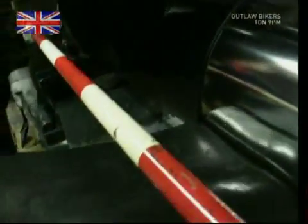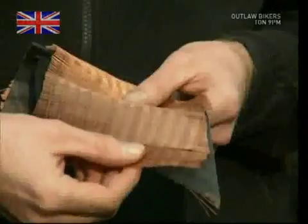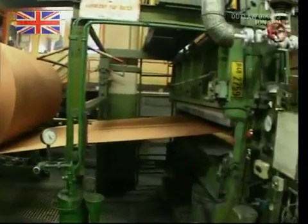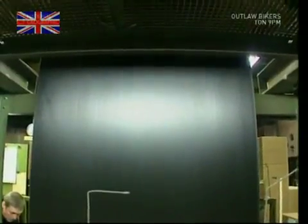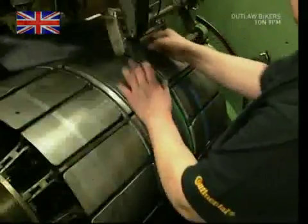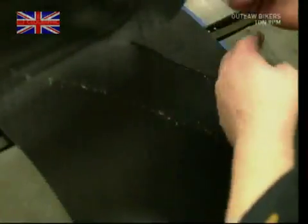When the mix is complete, fresh tire rubber emerges, ready for the next stage. You've got your rubber, but there's far more to tires than that. To create the carcass, nylon matting is added to make it stronger. Enormous rolls of nylon are threaded up onto these machines to be combined with the rubber mixture. It needs to be spread out like pastry, so the workers feed it back onto the rollers. This will create a big sheet of rubber, and the nylon can then be added in. This rubber-nylon sandwich is what makes up the basic material for the tire's carcass. When you're building a tire, you always start with the carcass — this foundation is expertly wound around a tire-sized barrel and glued into place.